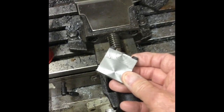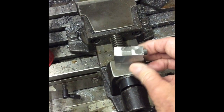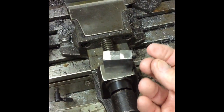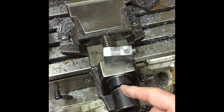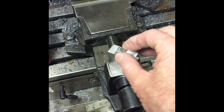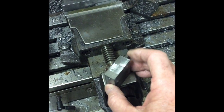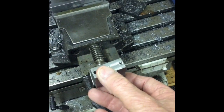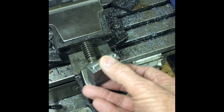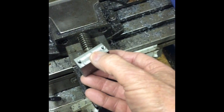I've changed the design on the block — I realized a couple of things while making it. If I had the two bits down on the side it's going to cause problems when I want to pull a piece of rolled steel out, because I've got to remove the roll and the bush. If that's located inside the flange — the end plate — I can't just pull it out, so I'm going to work at just having it sitting there using the roller as a guide.